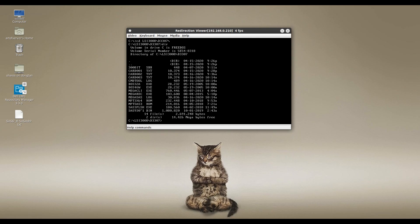Since the card is originally in MegaRAID mode running MegaRAID firmware, you're going to need the MegaCLI tool to do this. The second tool is the MegaREC utility. You're going to need a very specific version — one new enough to understand the 3008 cards. In particular, the version for MegaREC is 01.02-020, dated August 4th, 2015. I'll leave those details in the description of this video.